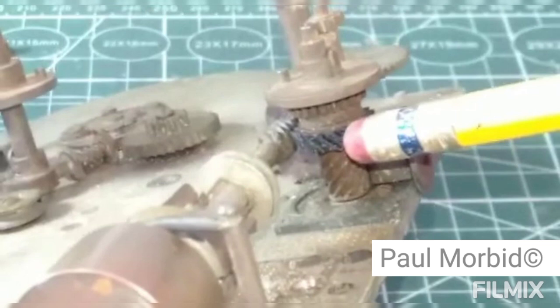So you have to get a professional case. You've got to have a cool and dark climate in your house to store the camera. You don't need the sunlight beaming directly on it from any window or anything like that. And you've got to keep it clean and lubricated all the time. You really do. You've got to know how to go in there and do some type of repairs, or send it off to a technician to do the extensive stuff, especially every 6 months. It's a definite must. The Bolex cameras, again, are made out of all those different types of metals, and they have to be kept up to maintenance. That governor down there definitely has to be kept up to maintenance right there.